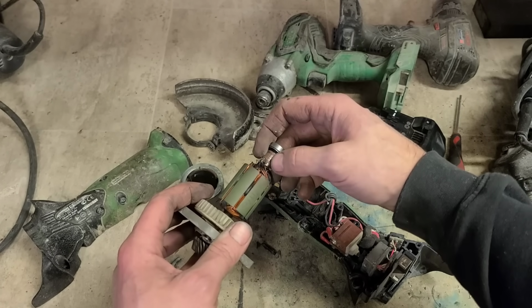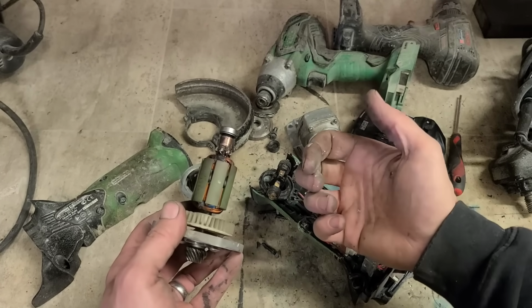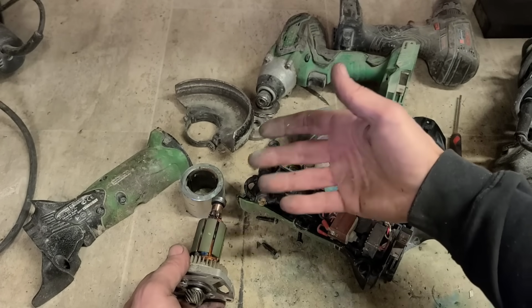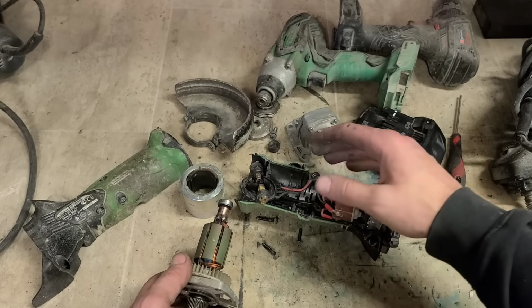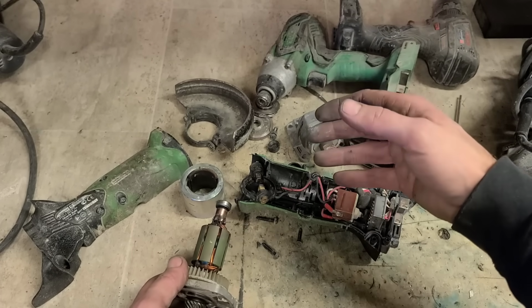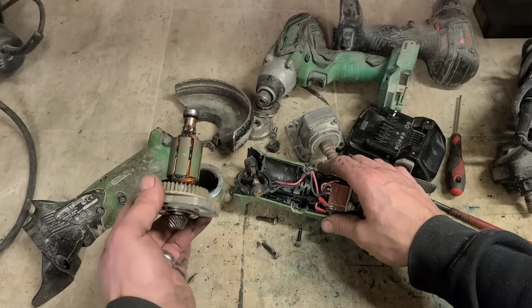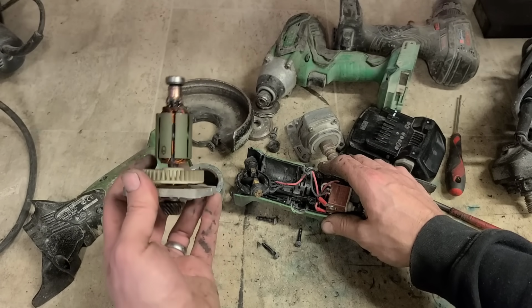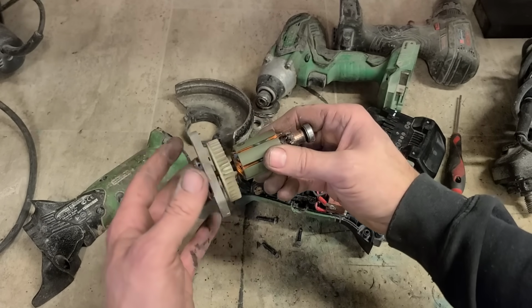This heats up, changes the resistance, then it takes more current to run it, meaning it generates more heat more quickly whenever you are using it. Boys get it back, they're assuming it's repaired and going to work the exact same as the last time, but it's not. They can never do the same amount of work for as long. They just overheat, so eventually they start burning them up a lot easier. So doing this a third time is a bit pointless. It's just going to overheat very quickly again and do the same thing unless you change the armature.